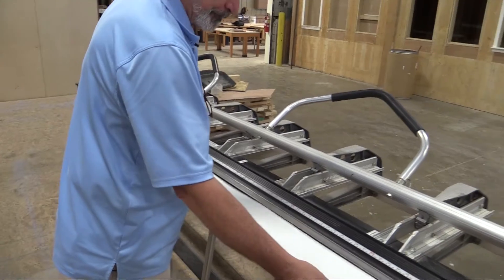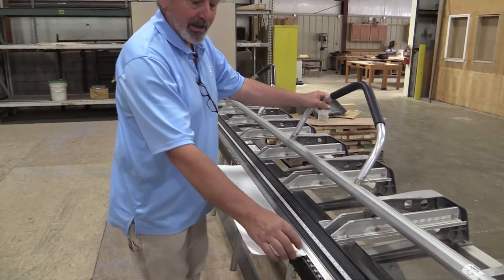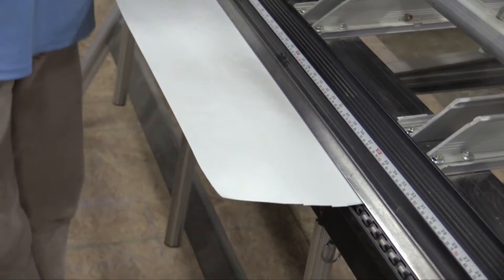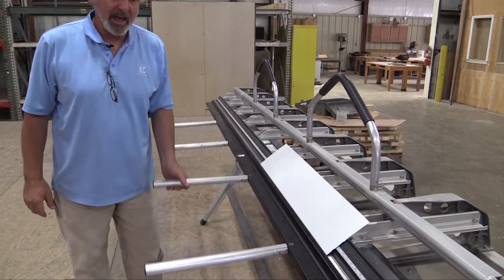With our cuts, we're going to bring our metal in, and if you notice, by cutting it I can bend that up and I can use that bend as a stop. So I'm going to bring it up, lock it into the brake, then lift it up and we're going to make what's called a hem.